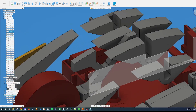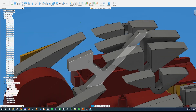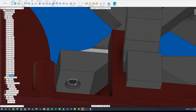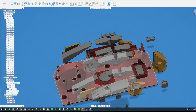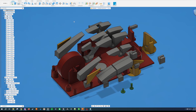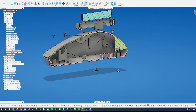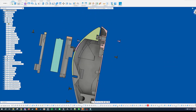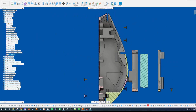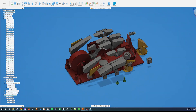The DPI button incorporates just like the hinges, building up into the top part. You put a little screw there and it actuates the DPI switch. I did a custom one for someone — it's not something I'm probably going to do moving forward since I don't use DPI buttons, but I built it so I might as well include it. It's built in the same way, oriented so that when I print it up top it'll print from the bottom without needing supports. Obviously you could build the DPI button completely differently and probably better — this is just simple.